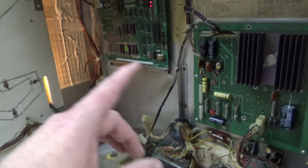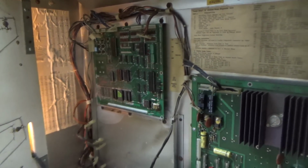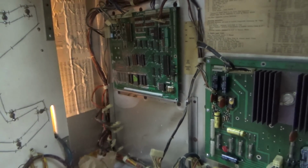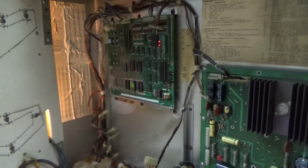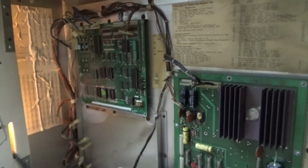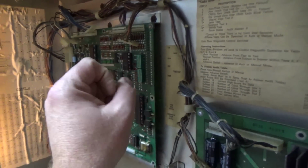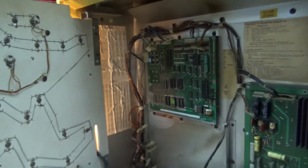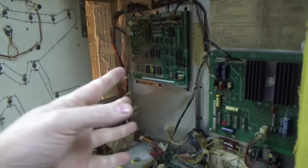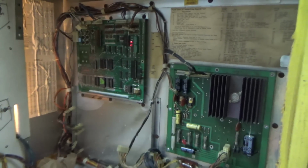So I've got a driver board in the back we're going to check out, and we're going to see if we can fix it and test it with this test EPROM. If you want a copy of Leon's test EPROM, you can get it from pinrepair.com. Clay consolidated a bunch of that information many years ago, and that's where we learned how to work on these. So the thing is up and running right now. That's why it's blinking those LEDs. It's basically blinking all of the outputs, and once we attach the driver board, it's going to blink all of the outputs on the PIAs on the driver board as well. So we'll do that here shortly.